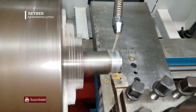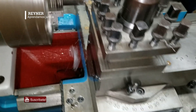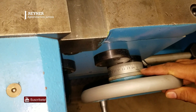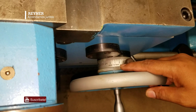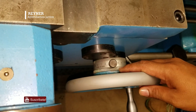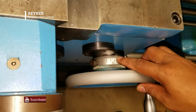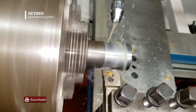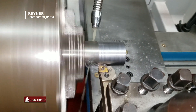The distance we are going to control is 54mm. Right here we are at 20mm, here at 25mm. Two turns will be 50mm — each turn equals 25mm according to the graduation of this lathe, on this model, because it varies between machines. So we are going to reach 54mm.